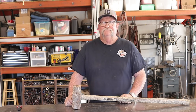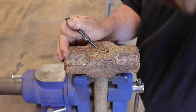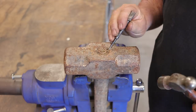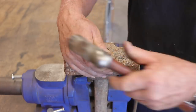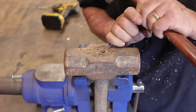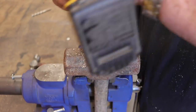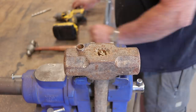The first thing I need to do is get this handle off. There are several ways to do this. Although the sledgehammer looks old, I don't think it had much use — that handle is in there so tight. Usually I take these steel wedge rings out using a punch and they lift right out, but of course not this time. I had to resort to drilling the center out, and I still couldn't do it. I ended up drilling the outer edge with a smaller drill to clean up the wood and loosen it further, and once I did that the ring came right out.